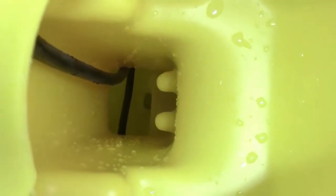So what we're going to do is turn on our pump, and we want to make sure the injector is off while we do this test, and since it's the next step, we've already got it off. So I'm going to turn on this pump, and once it primes, you should see the water returning, since I'm not going to be spraying the gun. So let me show you that. You can see the water trickling back in. I'm not spraying the gun, so that's what it's supposed to be doing.